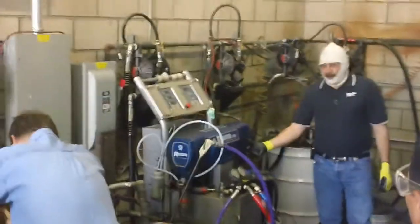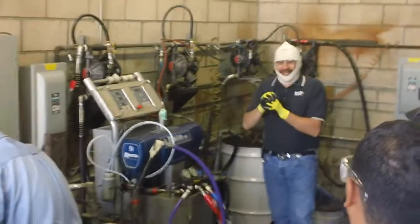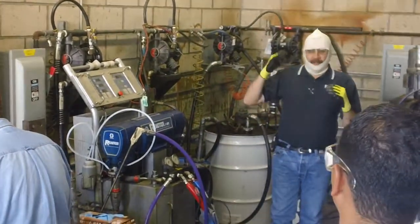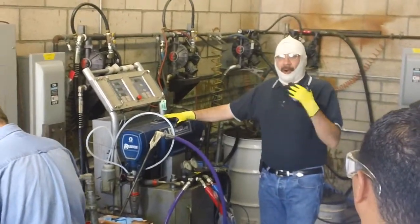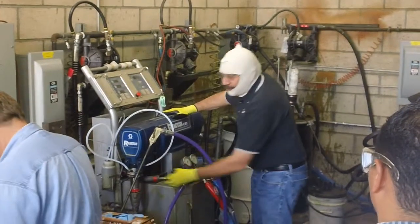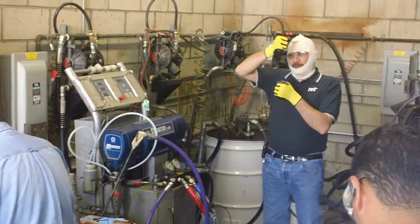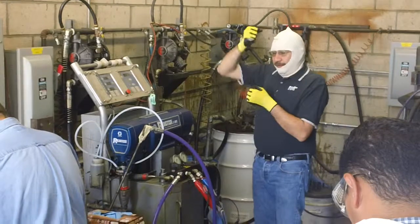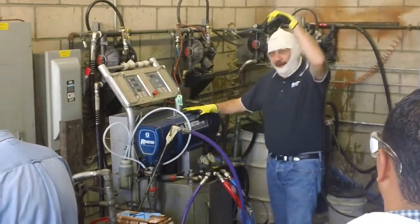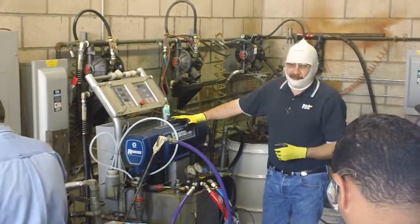We don't have that on our B-side shaft — our B-side shaft is open to direct air. These seals will leak a little bit over time. What's going to happen if we get ISO built up on this shaft? It's going to crystallize. So when we shut this machine down, we always want to park it. When we retract the pump, we're parking this shaft down inside of this piston, inside of this cylinder. If we leave that shaft out and come back weeks or months later — probably a couple of weeks being the most — we come back and start that machine up with crystallized or hardened ISO around the shaft. When this pump strokes down on that discharge stroke, it's going to damage our seals and our throat seals. Now we're going to have a really big leaking pump.